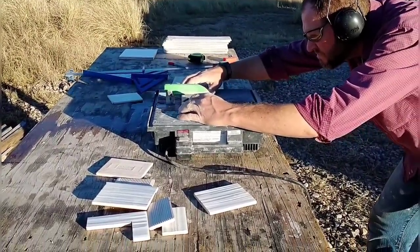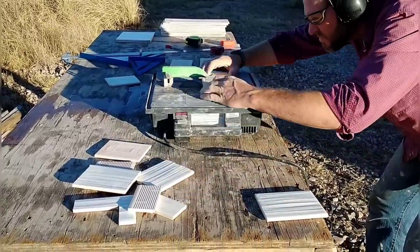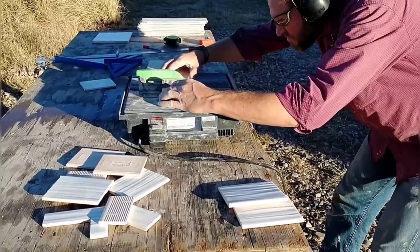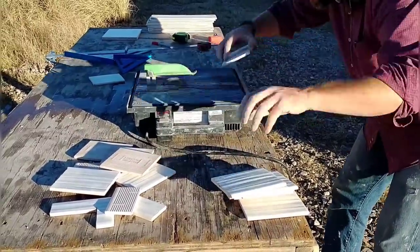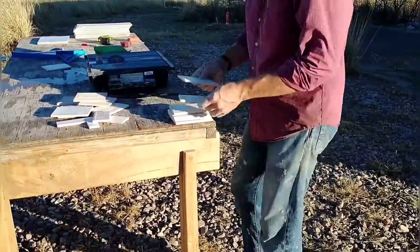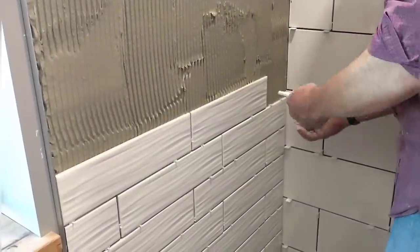Here's a look at our tile cutting setup. I'm just using my old workbench moved closer to the house and a very old tile saw that was given to us years ago — it still works great. We had to replace the blade with a new diamond blade but it works fantastic. Most of my cuts are freehand: I draw a line across with a marker on the back side and then just freehand it through. I never use the fence.